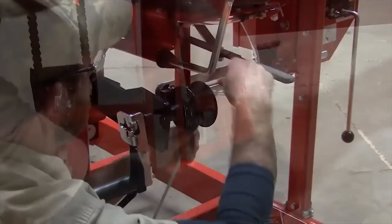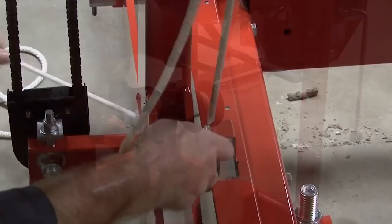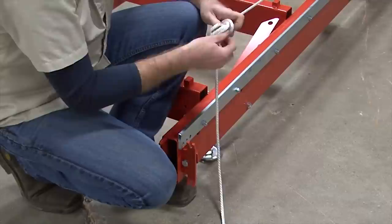Bring the rope up to your crank handle pulley. Go over the top and loop around two times toward the feed handle. Then go to the outside groove of the lower idler roller, then back through the mast, making sure that you are over the top of the retaining pin. Pull the remaining rope back to the rear of the mill, tie a knot in the rope, and put it into the rope bracket.